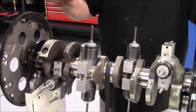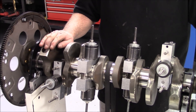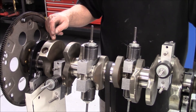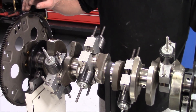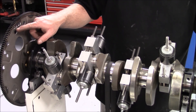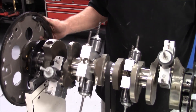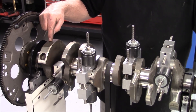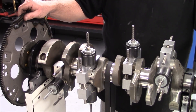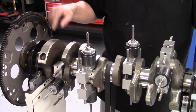We're heavier on the back counterweight than the front counterweight, so we're going to work on this back counterweight first. What we've done to shift where the weight needs to come out of this counterweight is we've taken some of the existing holes — one here, one here, one here, one here — drilled them out bigger and added three extra holes here. We're going to go back there and chamfer these. Now that the weight wants to come out about right here, we're going to go after this counterweight and get some of this counterweight off this flex plate instead of drilling holes in the back of this rear counterweight.